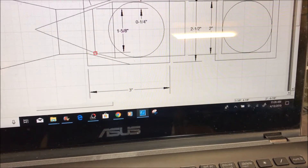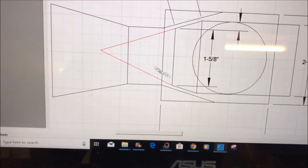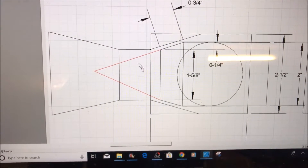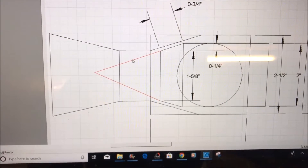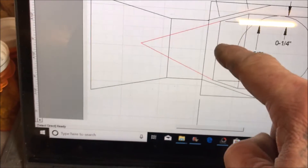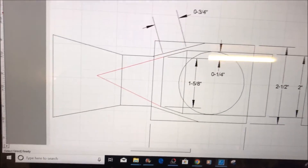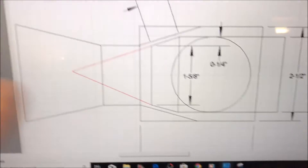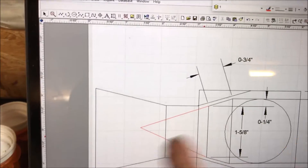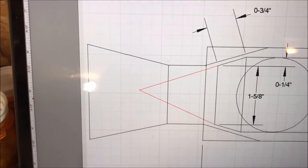The air shoots out making this cone, and everything inside this cone is under huge vacuum. Say you've got air molecules just bouncing around — as soon as they hit this airstream, they get swept away at like the speed of sound. As these air molecules are bouncing around in here, they're just getting ripped away by this slipstream of high velocity air. That is how this thing works — a molecule flying around minding its own business bounces into this slipstream and just gets ripped away. It doesn't come back; it's not an elastic collision — it's just stripped away.